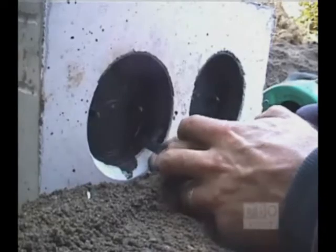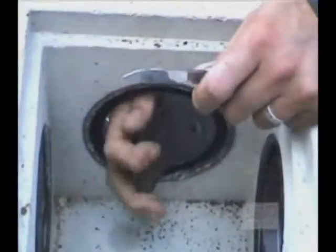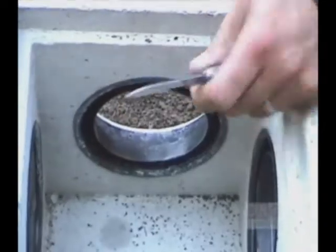The holes of the distribution box must be cleared. All you have to do is use a knife to make a cut on part of the diameter. Then pry off the black disc by pulling gently. Do not try to push through the rubber disc without cutting it first. You might break it.